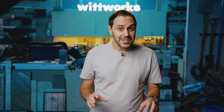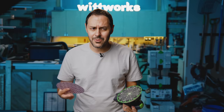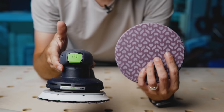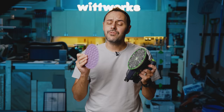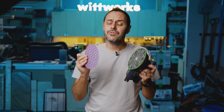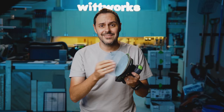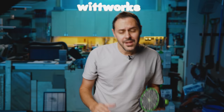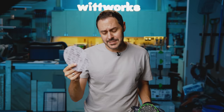The chances are you've encountered these two problems, and one of them you probably didn't even realize. The problem is you get your nice expensive sander — whether it's a Festool or a 3M, or even a Mirka — you get your world's best sandpaper, and then this is what happens: it doesn't stick. I was so frustrated when I got my pack of Extract and my Festool sander. And even the pure mesh version — there's no chance of it working. Super frustrating. The reason is the hook and loop system on these backing pads was not designed for whatever's on the back of these net discs.